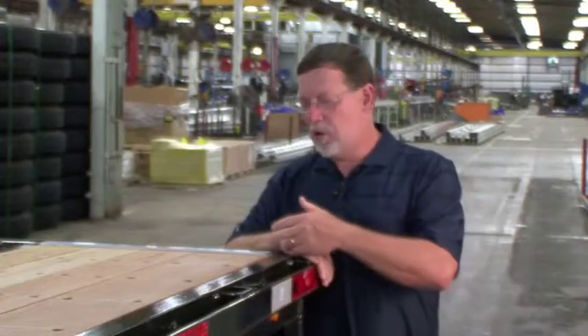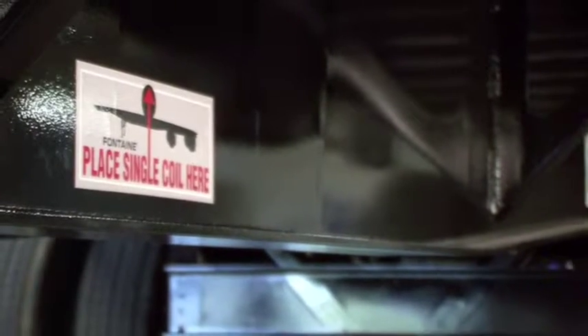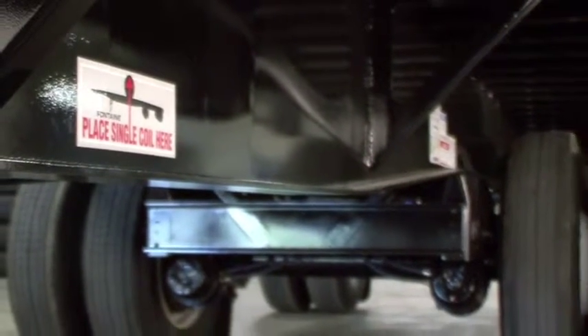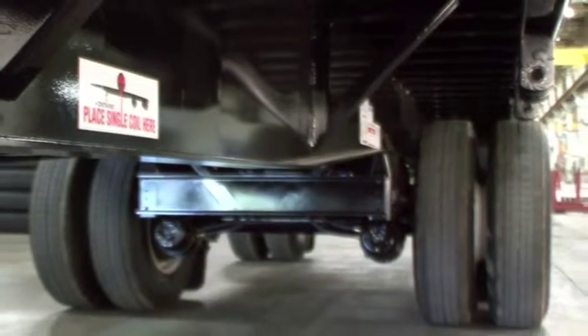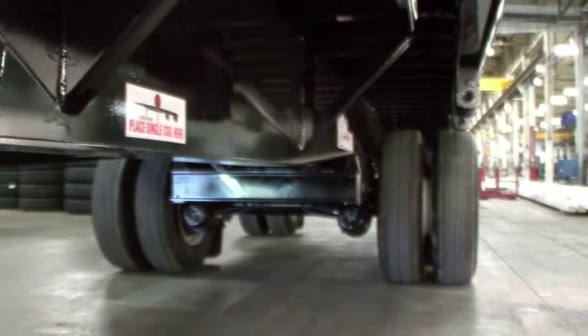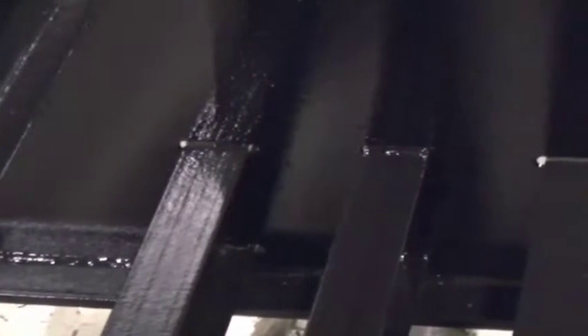We've added an additional cross member at the rear of the trailer to extend the life of the flooring. If your business is hauling coiled steel, the Velocity with a coil package is a great choice. The large single coil hauling package consists of two full depth cross members in addition to two 4-inch steel junior I-beam cross members welded between the main beams at the center coil hauling position. Coil packages offered by some manufacturers only provide additional support for the floor. Fontaine's design provides support for both the floor as well as the trailer frame by transferring loads back into the main beams.